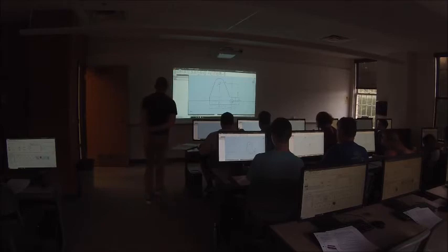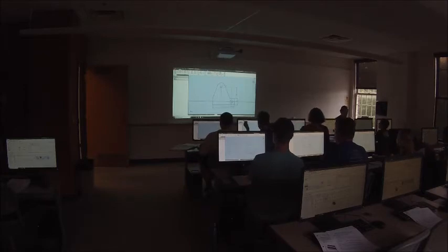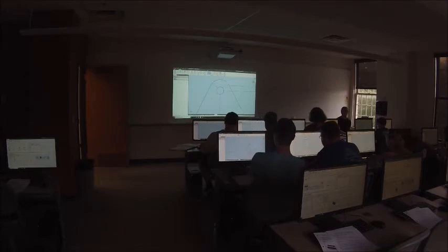We'll dimension the arc and then you should be able to do that. We'll solve this problem in a roundabout way. Just to get them out of a bind, let's dimension this top arc. If we get the dimension tool, we click on the arc. I think I just did 0.375. That gives it a small radius, but there's enough meat all the way around that you're not going to tear out this pin. If you make this too small, you'll end up fatiguing and breaking.